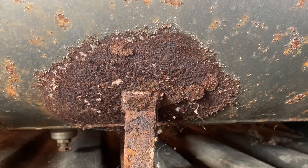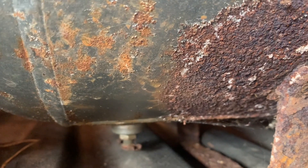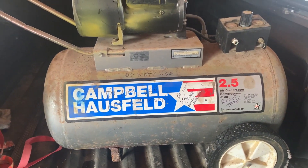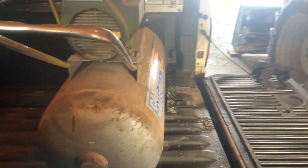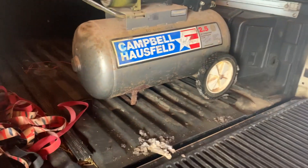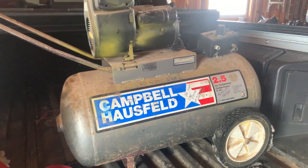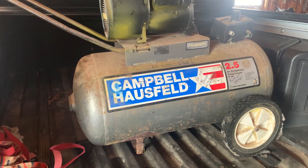To be honest, I really haven't been diligent about draining the condensation from that tap on the bottom. I've had this compressor for about 30 years, and it turns out I was probably gambling — because these things, when they blow, I didn't know how badly they can blow up. I thought if it just rusted out it would just blow a rust hole in the bottom, you'd lose the air, and go get a new one. But I've seen videos on YouTube where these things have just exploded like a bomb and blown out garage walls, ceilings, and doors.